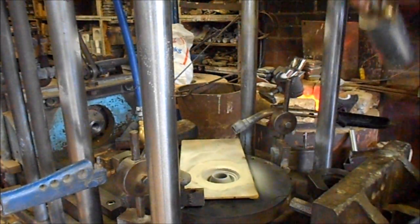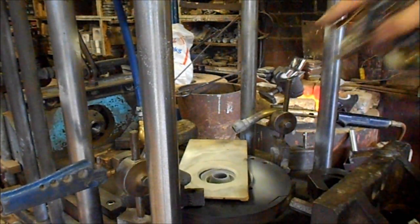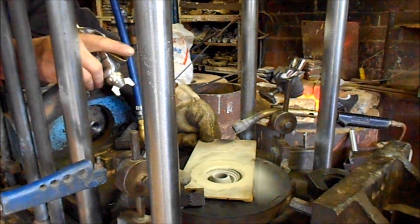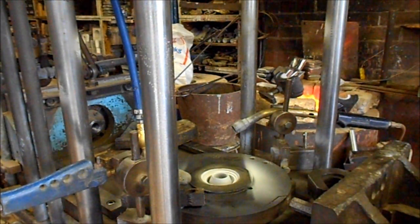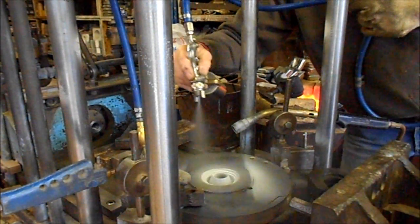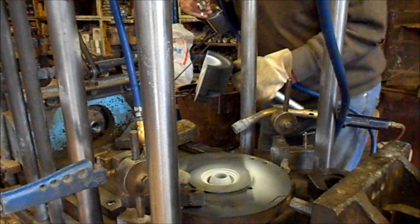It's going to be hot enough to dry. The second spray is a lubricant based on boron nitride, and unfortunately it's hideously expensive. We're going to heat it a little bit and let it dry.